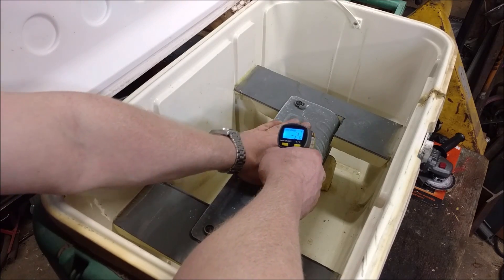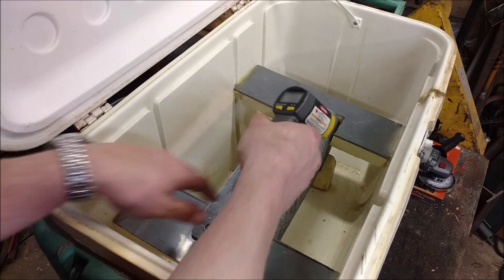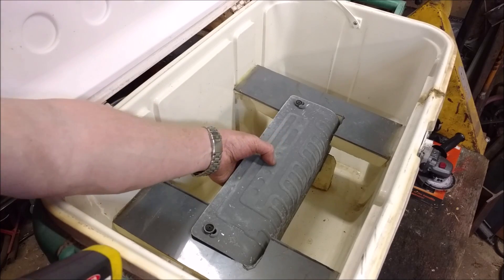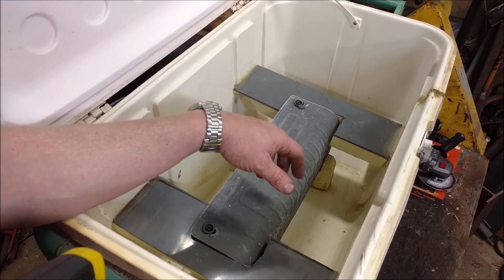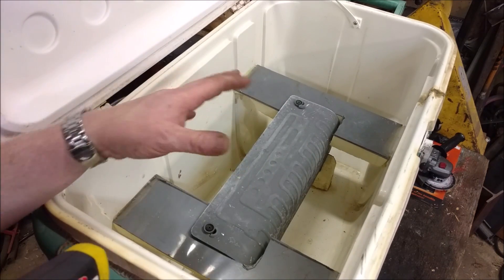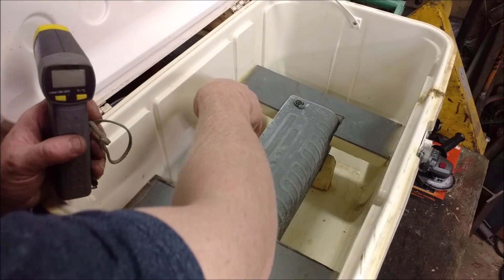It's very quiet — it's been running this whole time. It gets really cold: about negative 2°F, around negative 19°C. So whatever you put on the evaporator will freeze. There's a company that makes something similar called Engel or something to that effect, and they're about $800 to $1,000 for something very similar, but definitely more professional. This was just proof of concept built from free scrap parts.